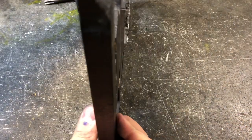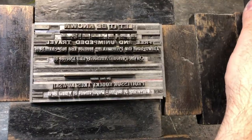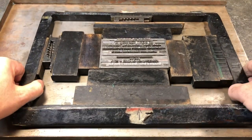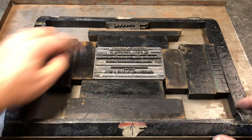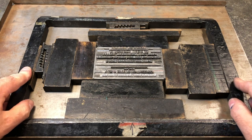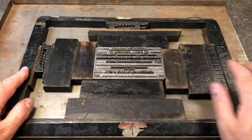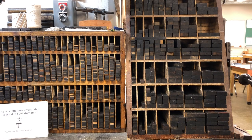There we have our beautiful locked-up form, and the back is almost as beautiful as the front. We're ready to either proof this, load this into a press, or store it for later. Assuming that we're going to store it for later, we can pick up our frame, our chase, place it on our galley tray, and then loosen the quoins. You never leave a locked-up chase under pressure in storage — it's bad for the type, it's bad for the chase, and we only have so many chases that we need to share them.